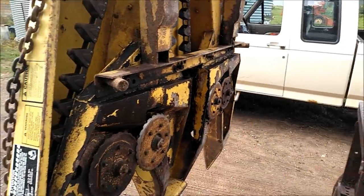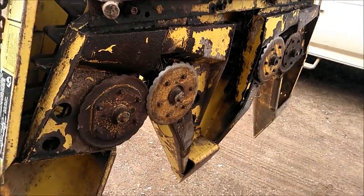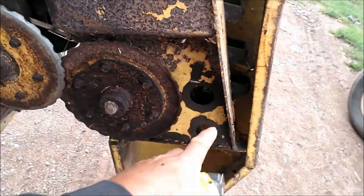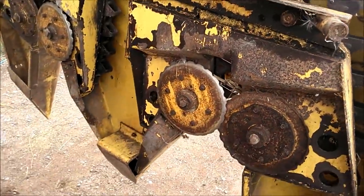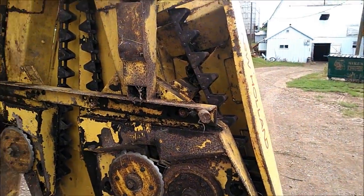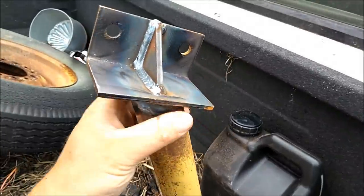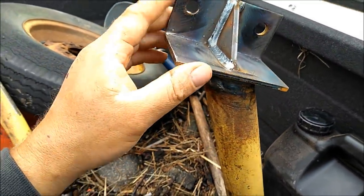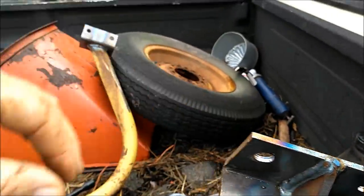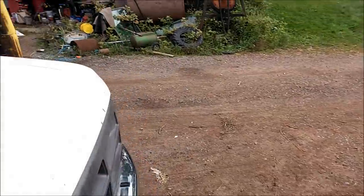We'll get it on the hay bine, go out and cut some, get it warmed up good, and let that stuff get into that injector pump — hopefully that takes care of the problem. Good morning everybody, it's Thursday September 3rd. It's really windy today. We're gonna see if we can get this corn head finished up today. Got all the bolts loose that I need loose, so I should be able to pull it together. I sprayed all the spring adjusters for the gathering chains down good and got them moving. I did get those arms back to the welding shop to get those new brackets put on.